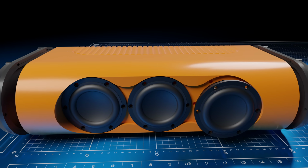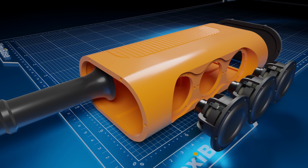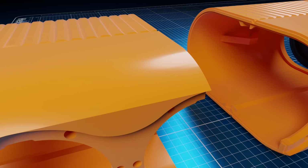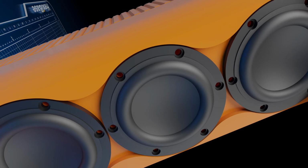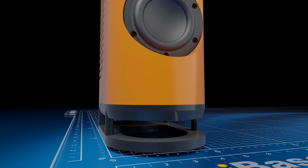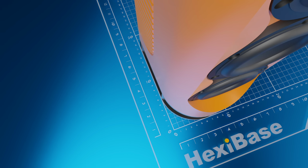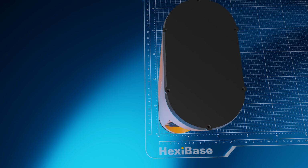The 2 end caps are removable for convenient access to any internal electronics, even though I'm building mine as an externally powered unit. The 2 halves of the main body connect along the usual tongue and groove joint. There's also a brace to help keep things rigid, and for anyone looking to stand the thing up like a PlayStation, there's also the optional diffuser base. Finally, in terms of size, and in an effort to accommodate just about any FDM-style machine, the model fits within a modest 120 by 220mm footprint.